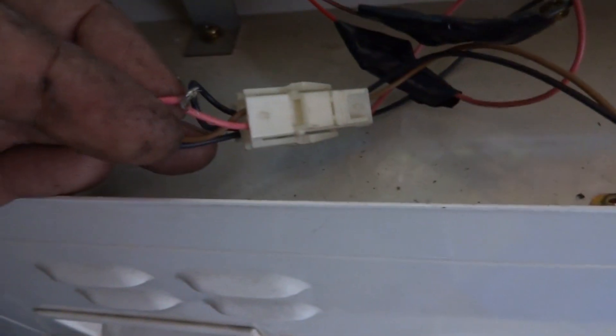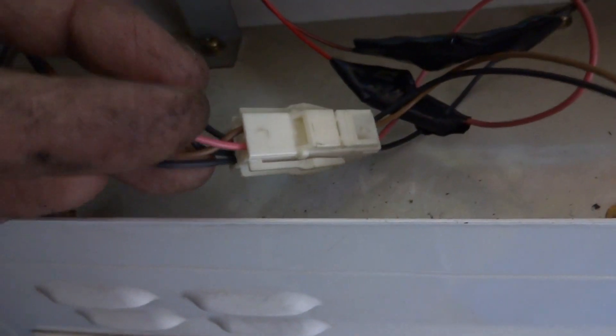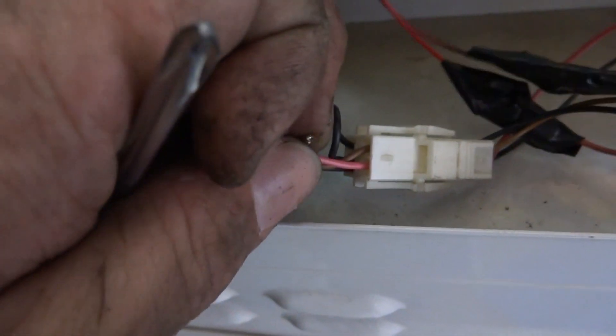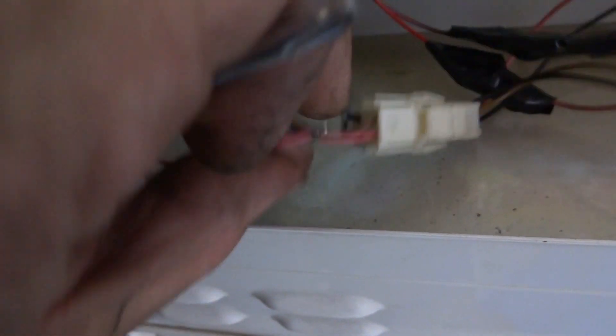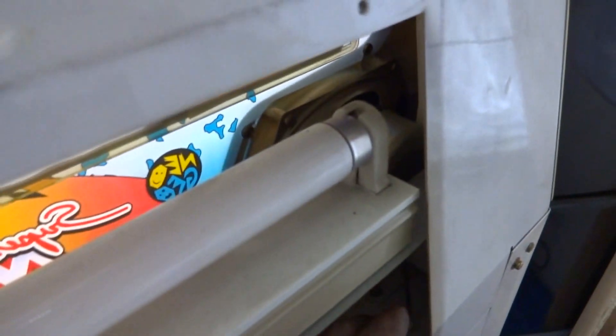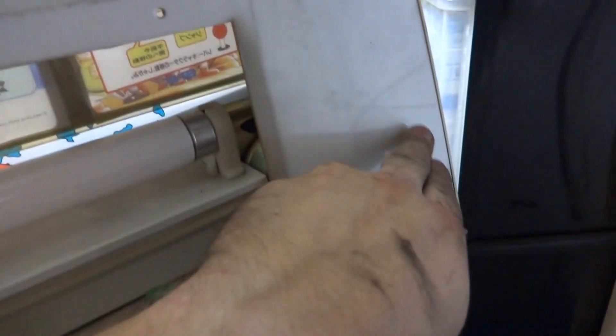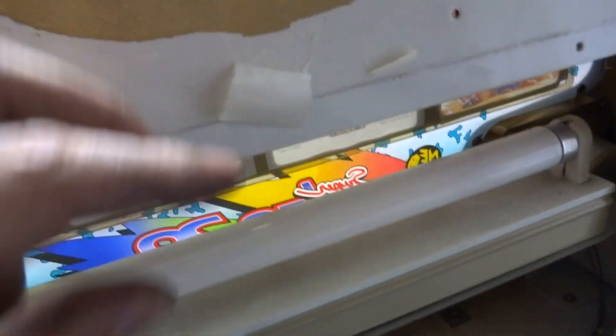While digging around in here I found a broken wire, which I just put a drop of solder on and I'm going to put a little bit of tape on — I don't have any shrink wrap right now but that was one of the issues. Over here in the corner, one of the wires was not pushed on all the way, so I just pushed that on. Hopefully those will be our culprits. If not, I'm going to have to remove the front screws and the screws around the bezel to let the front part flop forward.